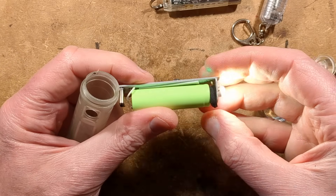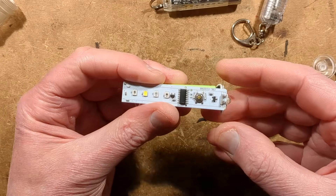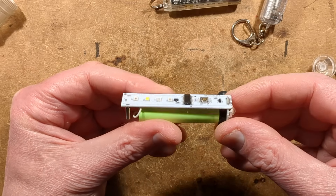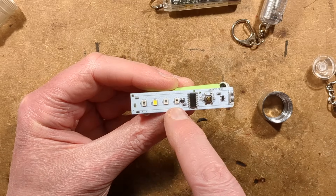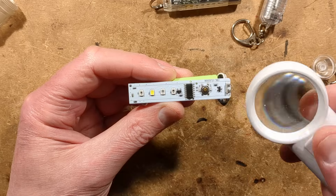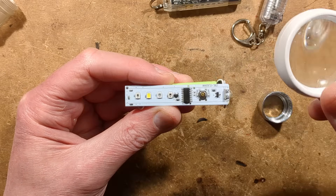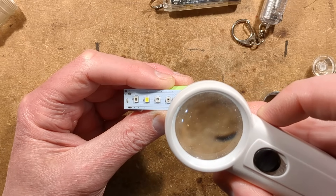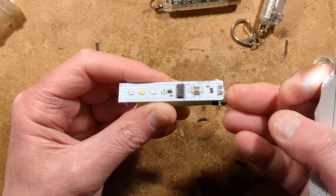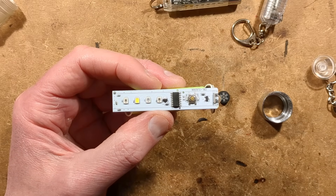The material around the battery is actually just a double-sided pad. I'm going to take this circuit board off the end of the LED — I don't think there's anything on the other side; I think all the circuitry is on here. I'm going to make a guess — are they driving the LEDs directly from the output of this little microcontroller? I'm guessing it's using the classic transistor and resistor for the charge circuit as sometimes found in those solar lights. The resistor value is 100 ohm and it's a J3Y — that's a classic lithium charging control, a very imprecise one. On the other side we've got a 3.3k resistor and a transistor switching the main LED. It doesn't look like there's much in the way of current limiting. I'll take some pictures and reverse engineer it.